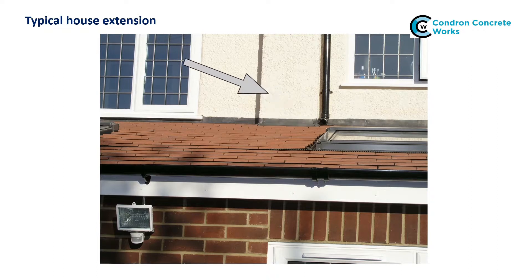This one has water shed directly above the side junction with the roof window — very bad practice. Condensation can also form in the batten cavity as water vapour passes through the breathable underlay from inside the building. So it's important to design and build the roof to allow any water that does find its way into the batten cavity to drain away safely to the gutter.